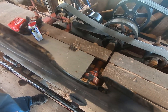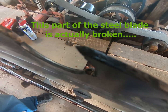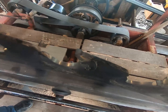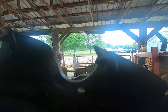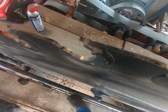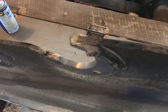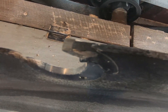All right, well here we go. So here's what happens when you hit a nice nail with the brand new carbide. It's missing, so Doug's already got it out. But take a look at these. These are brand new, except where he screwed some of them up by whacking a couple of pieces on them. It's a good one to show. That little chip in here. So what we'll do is we will change that out and see what happens. There's a little bit better picture of that thing zoomed in on it. And here's what they're supposed to look like when they don't hit nails.